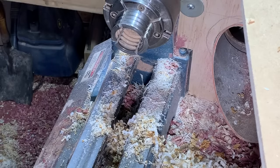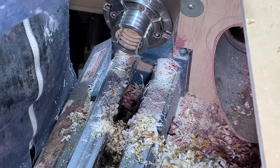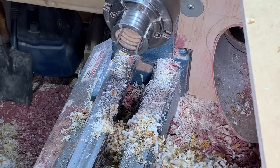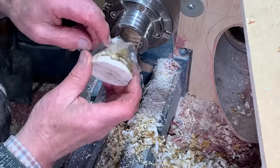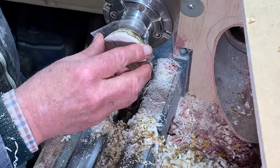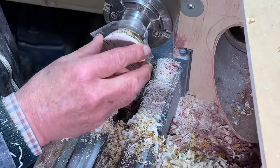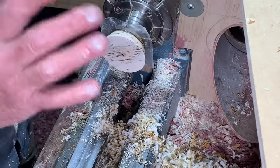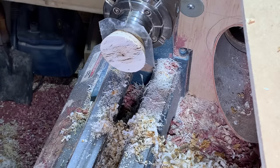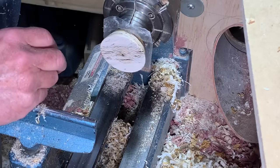That needs a little hole cut in it. So I'll have to do this off camera, just cutting a small cross in the middle of the plastic, so the end of that can poke through. So it's then a question of holding that steadily. The jaws grip. That's not a thing you can do with a lot of chucks. If the chuck has any kind of chamfer on the inner lip, you can't do this. Anything with those huge teeth, can't do it.